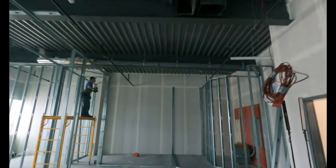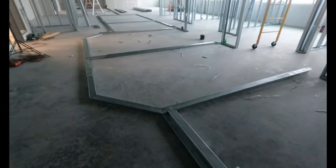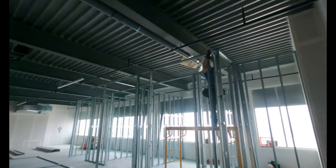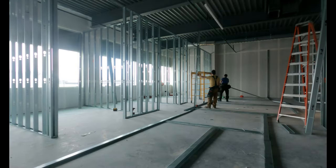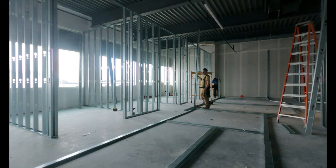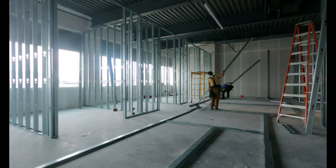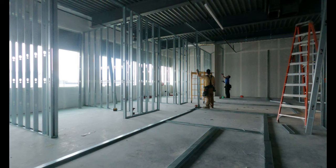This is the top track and how we're going to stand it — you're going to see some tricks here. First thing you want to do is get all the wall studs screwed in, shoot a laser on it, get your wall studs screwed in everywhere so it goes super fast. You set that track on the stud on the wall — that's your one side. This is a free-floating wall, not attached to the wall. My partner has the end stud in and we're just putting a screw in to hold it. He's screwing in both sides — watch, boom — that's awesome.